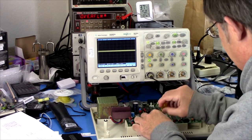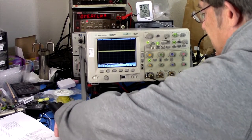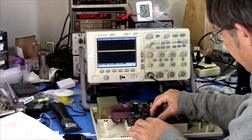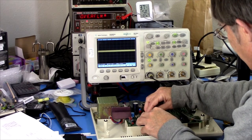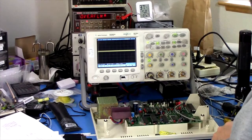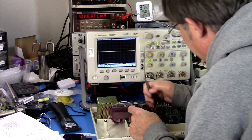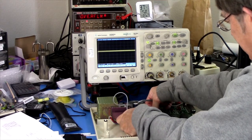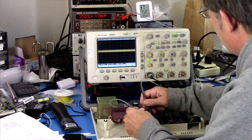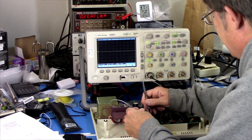The standard 6821, I'll set that aside. And so here's a 6821, which I'm going to plug in to see if this fixes the problem, because even though the pull-up resistors are different values, it should still be fine. Okay, and just by way of verifying, we'll check pin 2 to pin 20. Pin 20 is VCC, or plus 5 volts. Pin 2 is one of the A ports. Okay. 5.1 K. So they're not that much different, are they?